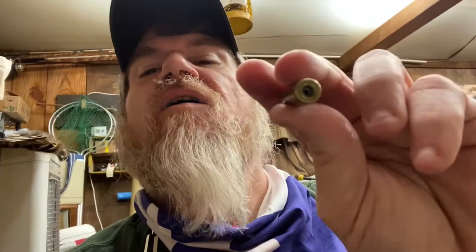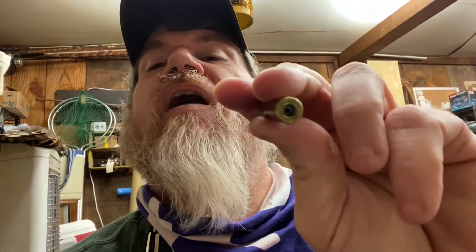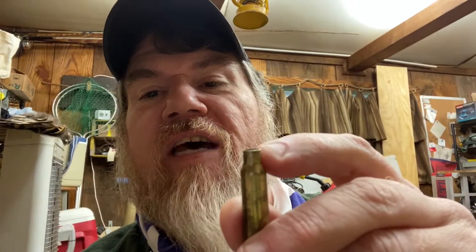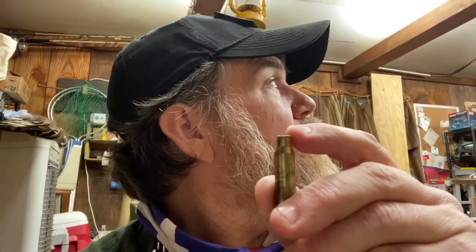What I'm doing now is cleaning the primer pocket. If you can see in there how dirty that primer pocket is — you've got to clean these pockets out to make sure that they fire right. We're going through and cleaning them out. You can see a brass liner in there now. Once you set the die in there, you just pull the handle down and back up, and it not only punches out that primer, it also resizes the neck both inside and outside.